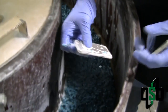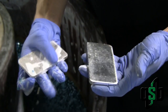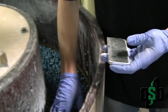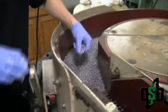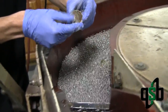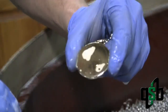We come to our burnishing machines and use various media. This one is a more aggressive media that takes more of the junk off and gives it a nice finish. We have other media that give more of a polish shine — these are stainless steel beads, which give a lot more of a good polish and a mirror finish for our proof-like pieces and different custom minting.